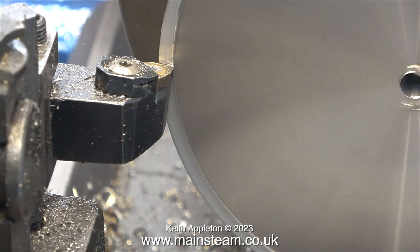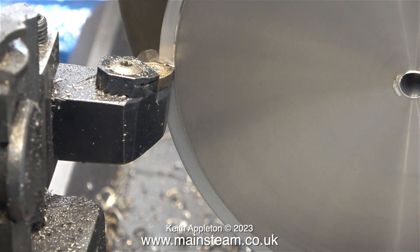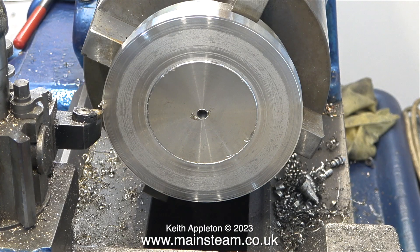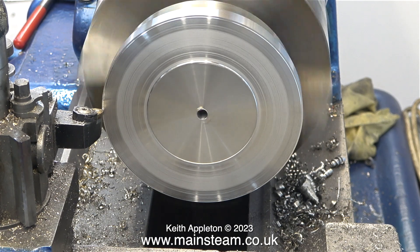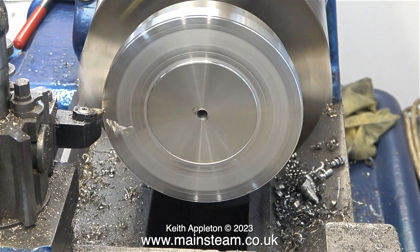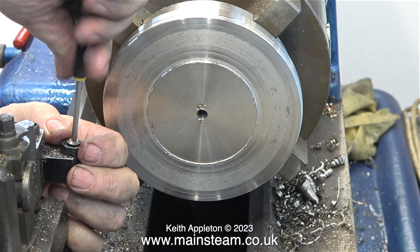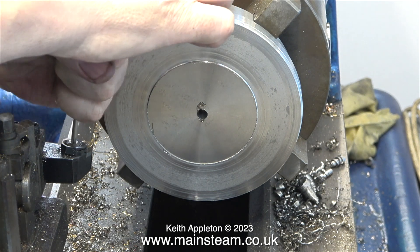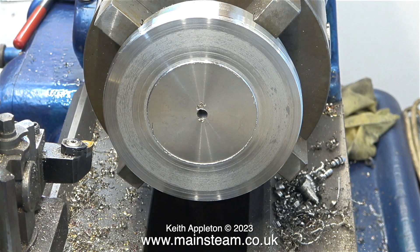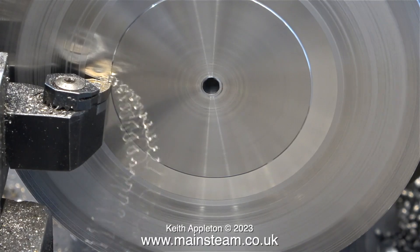And before I get the deluge of silly comments from the experts — yes, I do know this piece of metal is too big, and I did it on purpose, so I can show various ways how not to do the job, like this. Just to explain why it looks like this: the part that isn't shiny was where the tool was blunt. I applied too much pressure to the tool tip on a longitudinal cut and it chipped. When I used the damaged tip to face across the front, this is what it looked like.